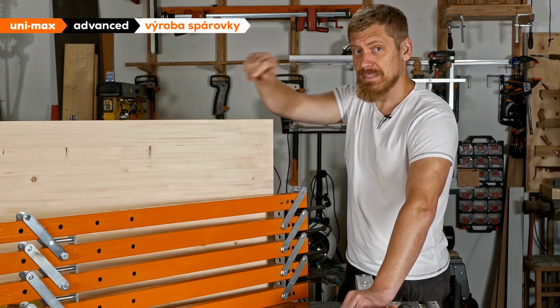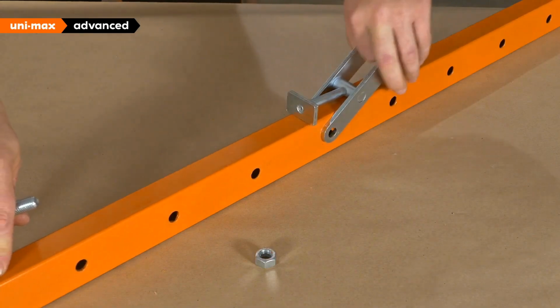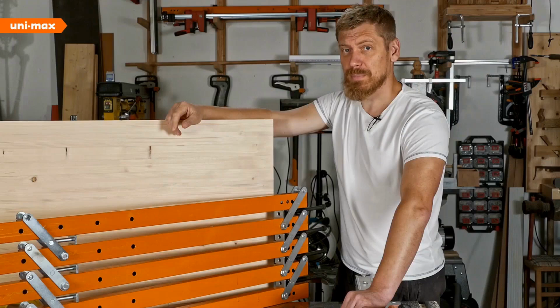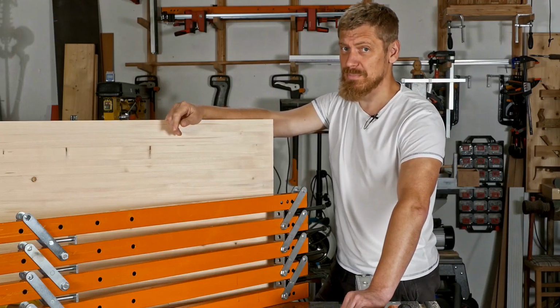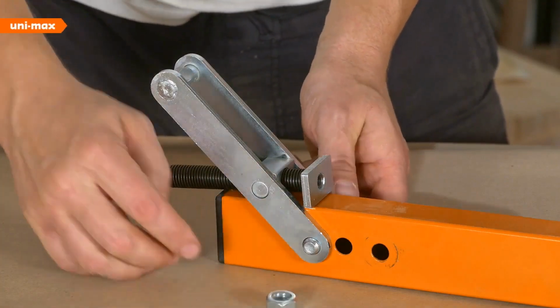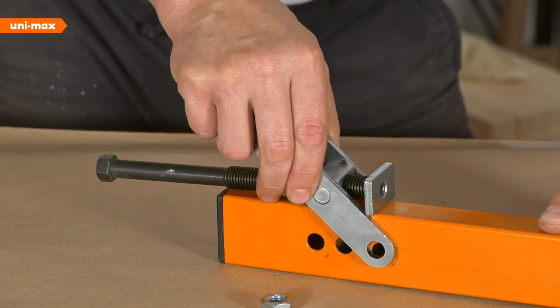At one end, there is a bracket with a screw base, while on the opposite side, there is a fixed bracket that can be adjusted in increments of 10 centimeters. The bracket with the screw base can also be adjusted within a small range to one of 3 positions, depending on the thickness of the laminated wood being glued. For thinner materials, the bracket is positioned lower, so it must be secured further from the edge.